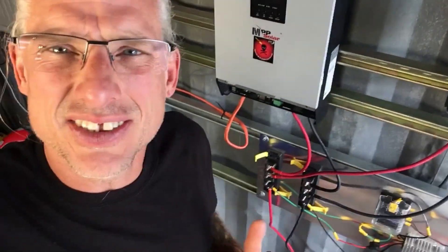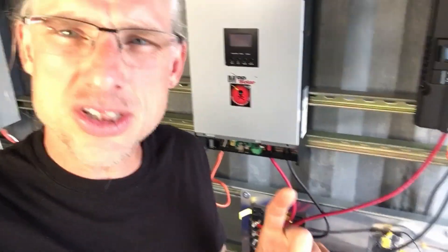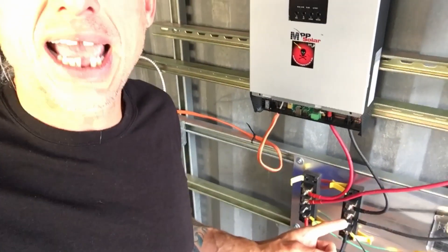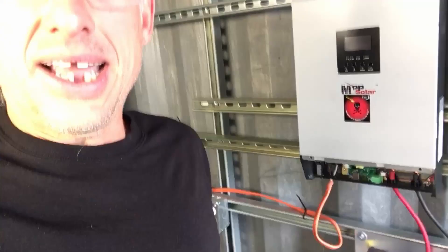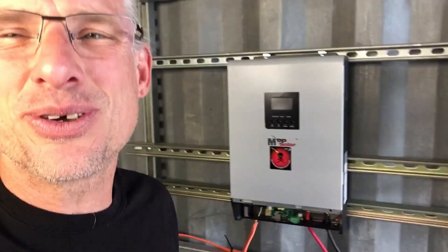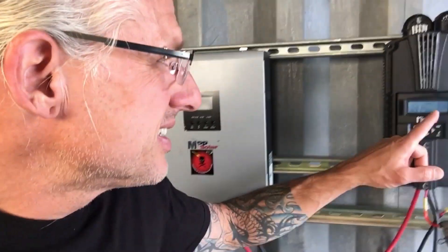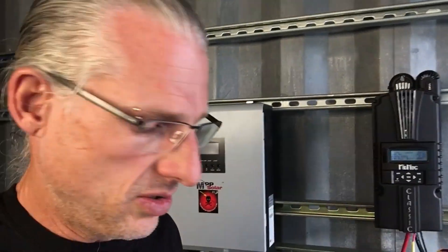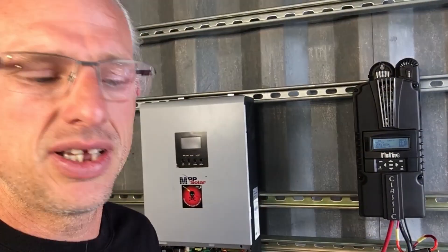This is all temporary the way it's set up. The wire way is going to be there, and then I need some other box that takes in the DC voltage. I don't know if just having that stuff in a wire way is gonna make me happy - I might just have it into like another breaker box somewhere, maybe even down there. Just waiting for this thing to charge back up so I can get to 46 volts, and it's a cloudy day. It says it's 43.6 here but on the battery it says 42.9. When it's gonna be able to charge all that up, it's already noon and it's cloudy. This may be all just stuck on the off position. I guess I could wire in the AC charger on this, which I've been kind of avoiding because I just don't want to cut an extension cord - that's basically what you do.